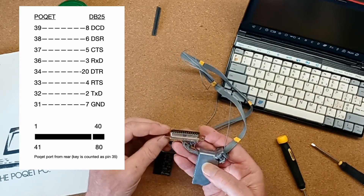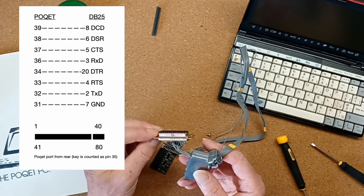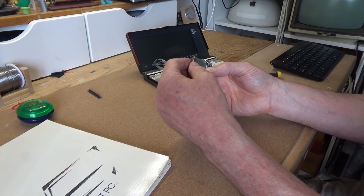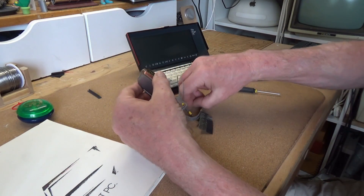With a bit of cutting and filing I was able to fashion a kind of plug that connected comfortably to the Pocket's expansion port. I soldered a ribbon cable to the relevant pins on the DIMM and a DB25 on the other end, and it worked perfectly. I've put the pinouts for both connectors up on screen so you can replicate this. Please be aware that the Pocket expansion port is known to be extremely sensitive to static charges, although at the time I didn't know this and went merrily ahead with my rather crude connector with no problems whatsoever.